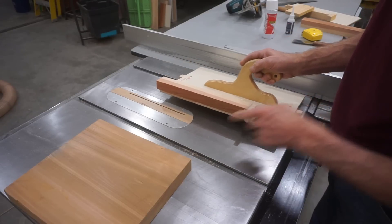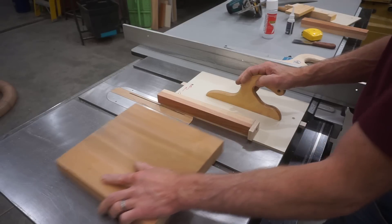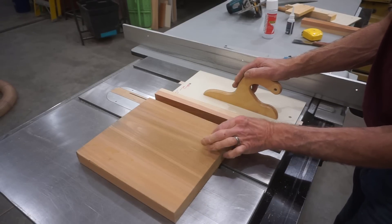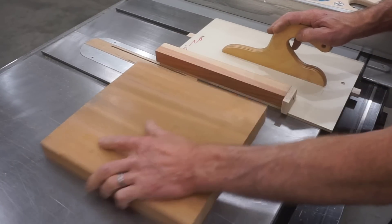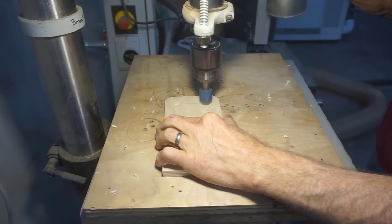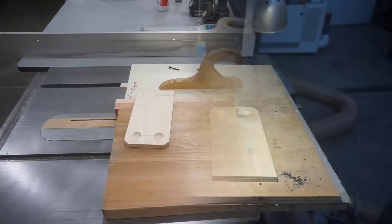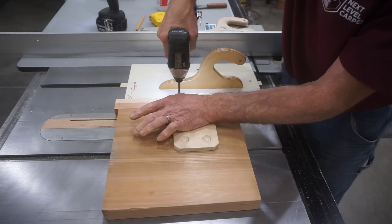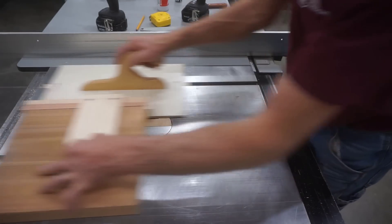You can see how that auxiliary fence and stop block will help guide the work piece past the blade more safely and keep my hands away from that spinning finger-amputation device. But since I want to get shims out of the entire width of the block, at some point that's going to be a pretty small work piece, and I don't want my fingers close to the blade. So I'll add one more safety measure: a hold-down block that attaches to this fence and extends out over the work piece. I used a 3 and 1/4-inch Forstner bit and a 1-inch Core Box bit in the drill press to put nice finger indents in the working end of the hold-down block, then position it about 2 and 1/2 inches from the end, countersink a couple of holes, and drive in 1 and 1/2-inch square-drive screws. Now a little finger pressure out here will keep the jig working safely, efficiently, and smoothly.